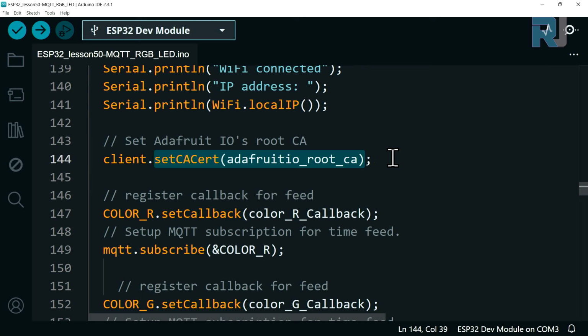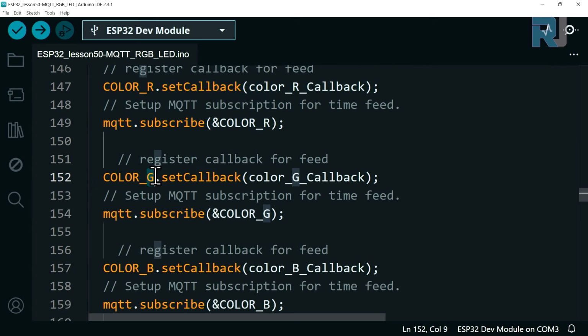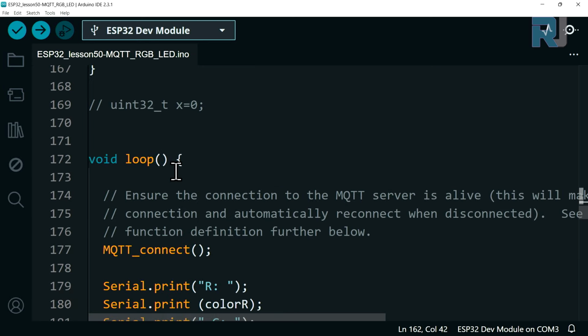And then this is initializing the certificate for the client that we are connecting. Now, these two lines are for red color, so we are getting the subscription object set callback, and this is a function that I have written, color R callback, and then after that we pass this object to our subscribe MQTT subscription as a reference. So color R is here. Remember, this is for R, and this is G, and then I put here G and G. These two are for green, these two are for blue, and these two are for RGB. And these are functions.